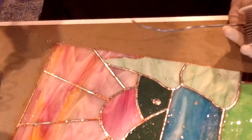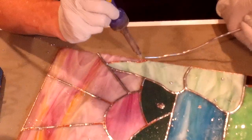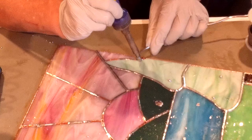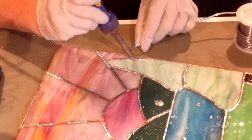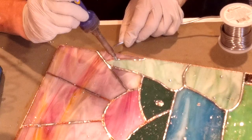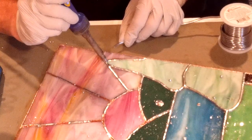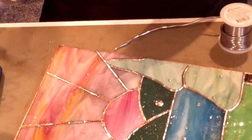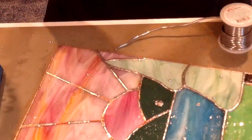Okay, so let's, again, wipe it once on each side, start a half inch back from the edge, add solder on the side to get that bead going. So this is forming a T joint. Instead of an L, I can go off in a T also. So I can go straight off the end if it makes a T, letter T. L, T.